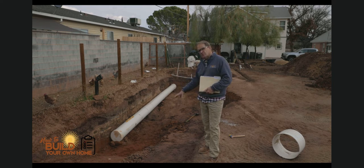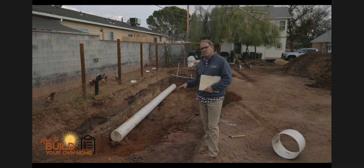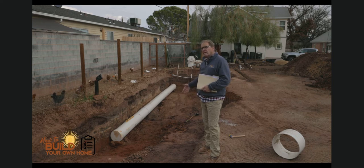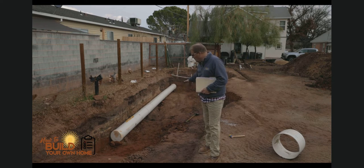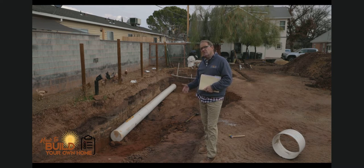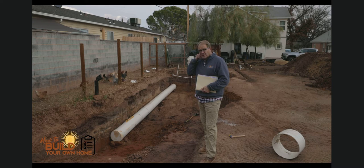The goal is that during the summer, the temperature at the five to six foot depth is a constant 52 to 54 degrees. During the winter months we'll capture heat high up in the greenhouse, pump it down into the ground to bank it, then pull it out at night to keep the greenhouse warm. In the summer, because the earth is moist, we'll bank moisture into the ground, and the cooler temperature will provide a slight assist in keeping the greenhouse cool.